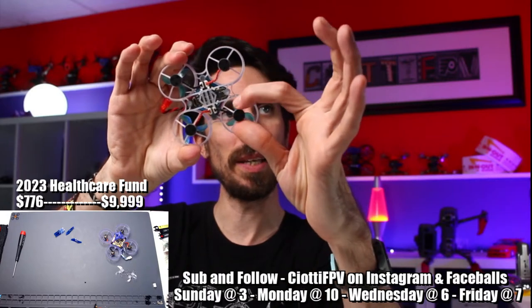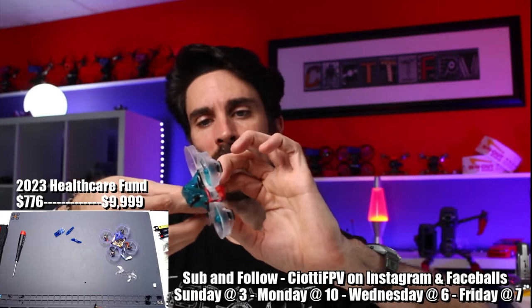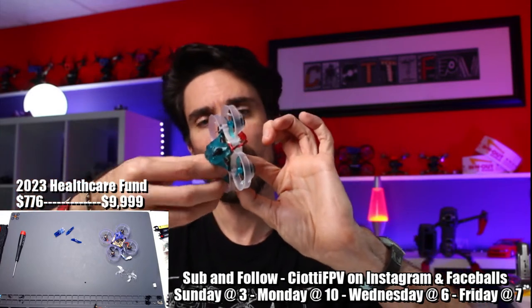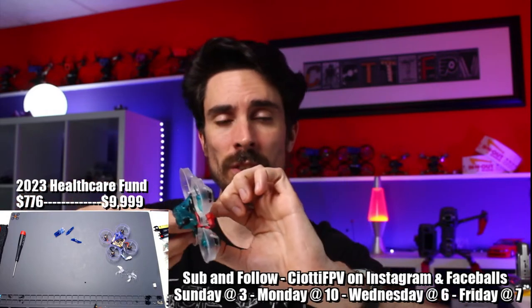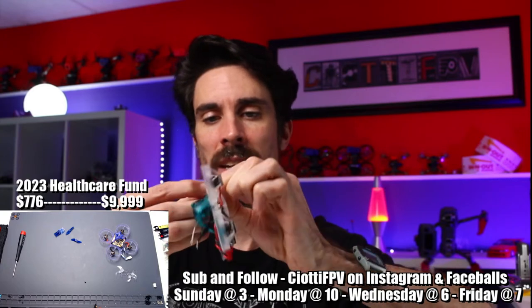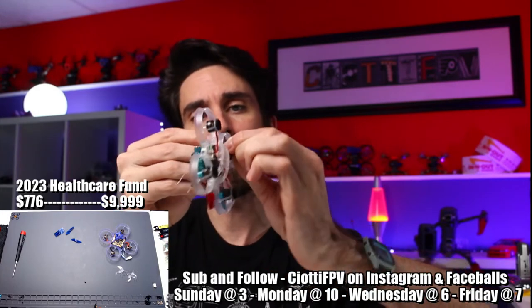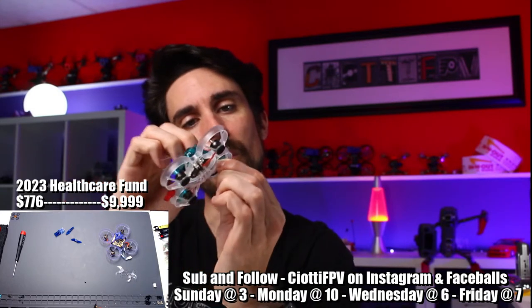Pick a gap in the standoffs where the motor wires aren't. Pinch the bell of the motor in your left thumb and forefinger, in your weak thumb and forefinger. And then for the propeller, you want to try to grab two, if not three, if you can fit your fingers in, of the blades so that you hopefully don't bend them. The Azzy props are very easy to bend the blades of, and then you can't really bend them back straight. And you're going to just turn the propeller, and I just ruined one of these Azzy props. I just bent one of the blades up.